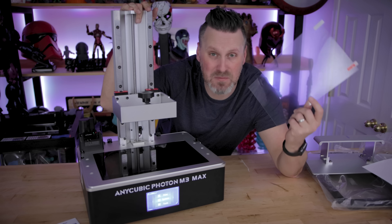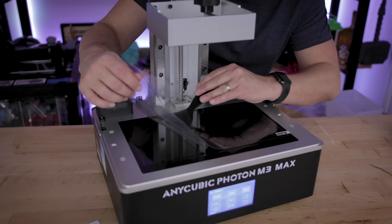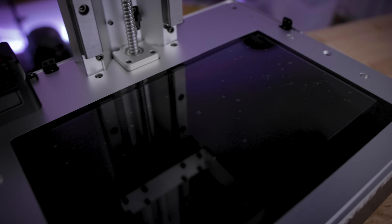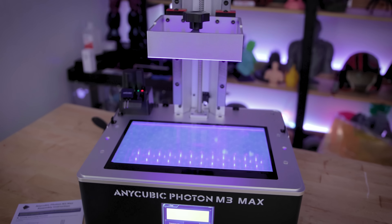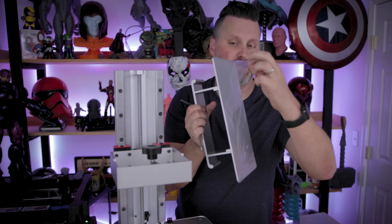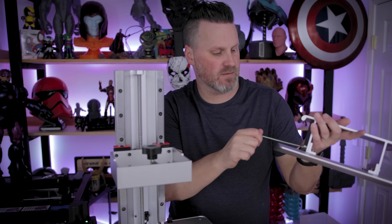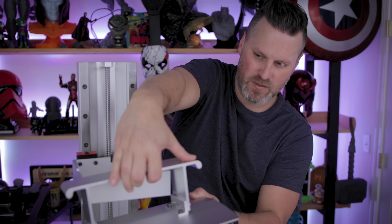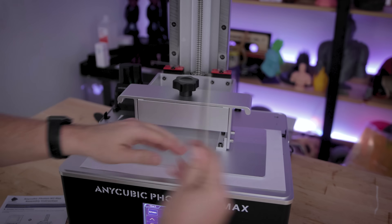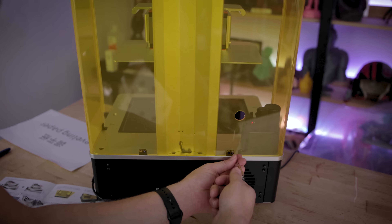As I mentioned during the unboxing, it came with a screen protector. I removed the initial layer of protective film and now I can install the screen protector to prevent any resin from curing directly on the screen. I still have a handful of little air bubbles from laying it down, but in my experience there's never really been any issues with that. Before installing the build plate, I'm going to run a quick exposure test to make sure the lighting unit is working properly. Also, make sure to remove any protective film on the build plate before you print anything. To level, we loosen the four bolts on the side of the build plate, home it, and then tighten everything back down using the large leveling paper they included.